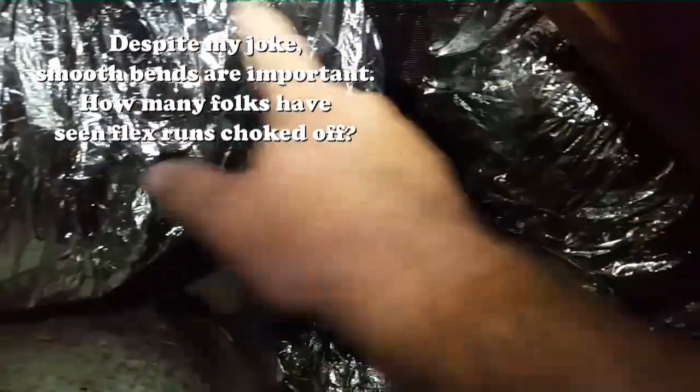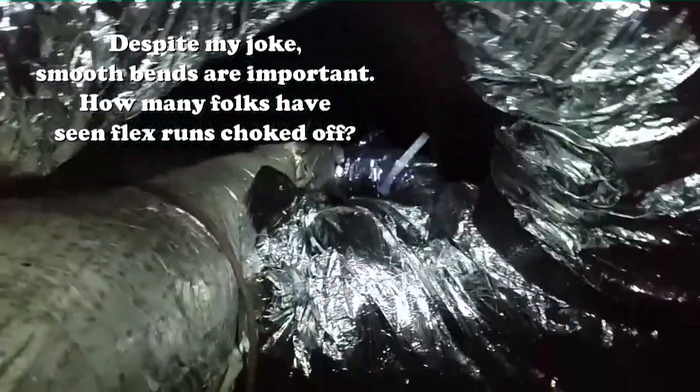Here's our manual D level loop. It comes around here, comes up over. It's going to rest on that ductwork. Not really hung because we got to go below the light. Have a Panduit strap on the outside of it. Bring it up to the duct, and there is a screw in the Panduit strap to hold it on, just so it can't slide back off under tension when I'm pulling it and in the future.